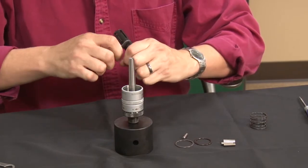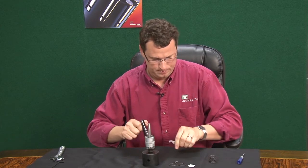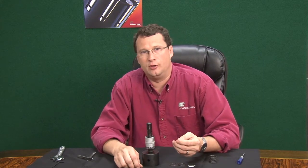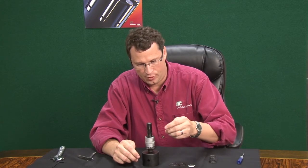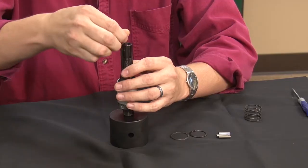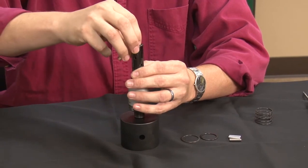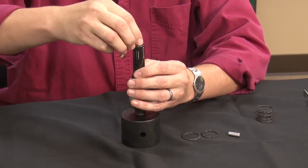Make sure it's snug with the spanner wrenches. Just slide this back on the mandrel. Now the tricky part is to install the rolls. There are several ways to do this — you can wrap the cage with tape, or you can pat the cage with any kind of band grease and it will secure the rolls in place. I'm simply going to reinstall it by pulling up on the tool before it's fully assembled. You want to make sure you do not force the rolls into the pocket, because it's a very tight fit and you don't want to damage the cage during this process.